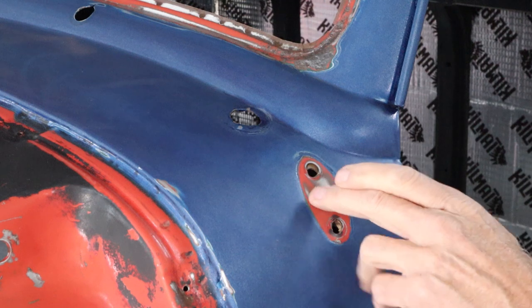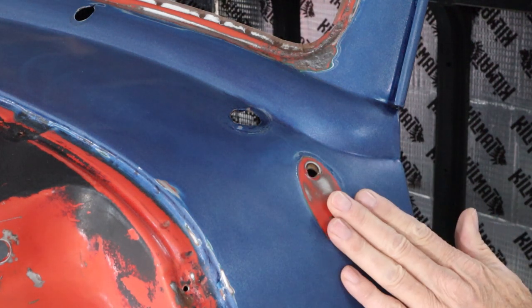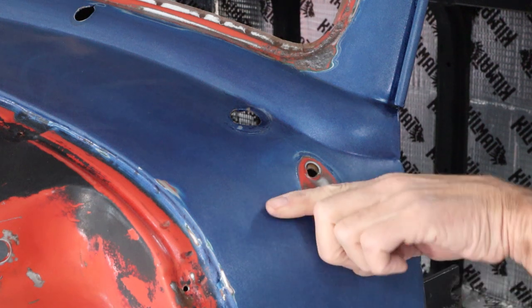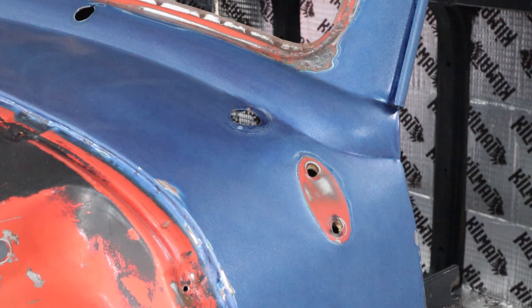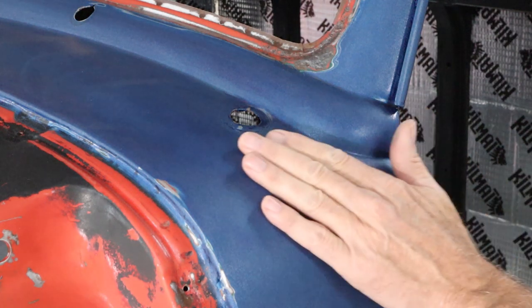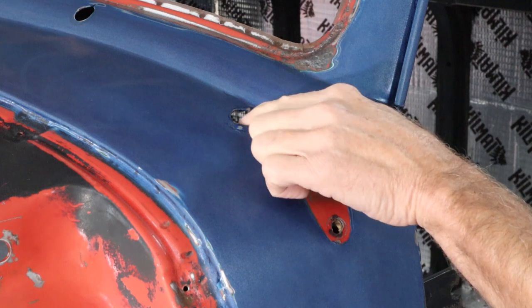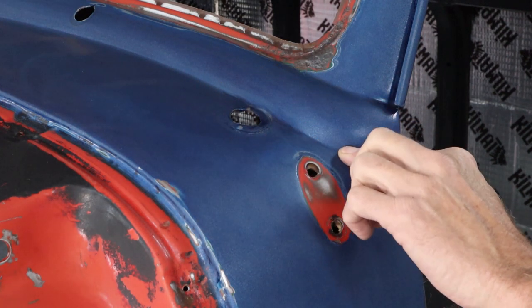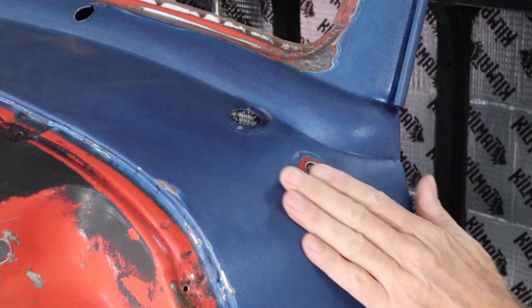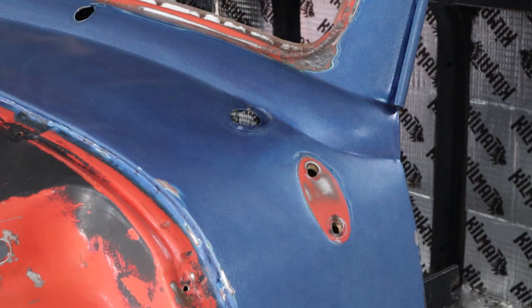Let's pull these off, hold the mirror up there and see how it looks. If I hold the mirror over here next to it, it's got a nice shape and it matches pretty well. When we hold it on there, it's going to be a good indication if we've got this straightened out enough. Looking down through to see if I can see light shining through — it's just hitting on the top on both ends and the middle is still just a little low. I don't even think I can get a piece of paper in there. A gasket does go on here when it's bolted up, but I still want to make sure I get this pulled out properly.